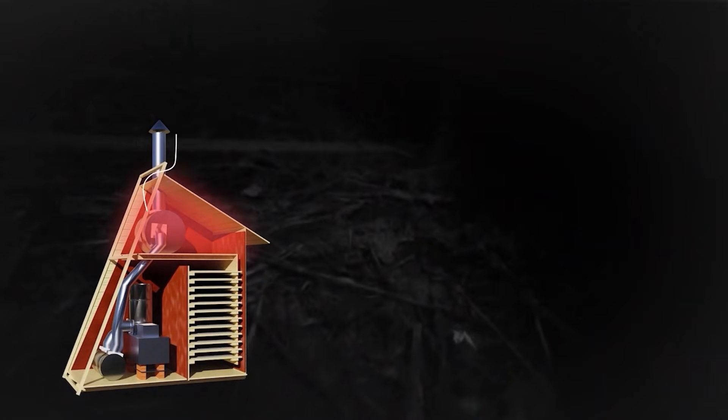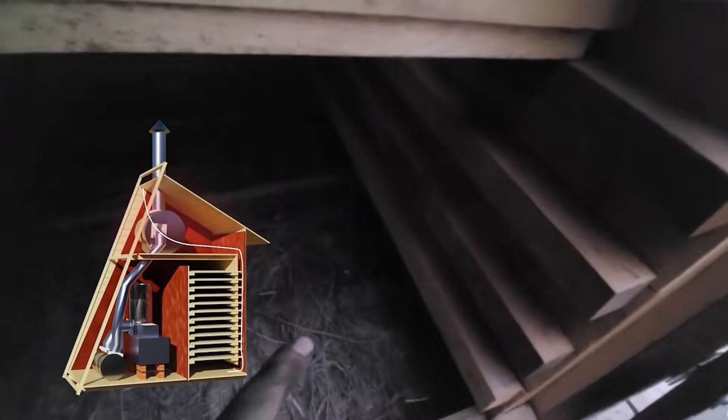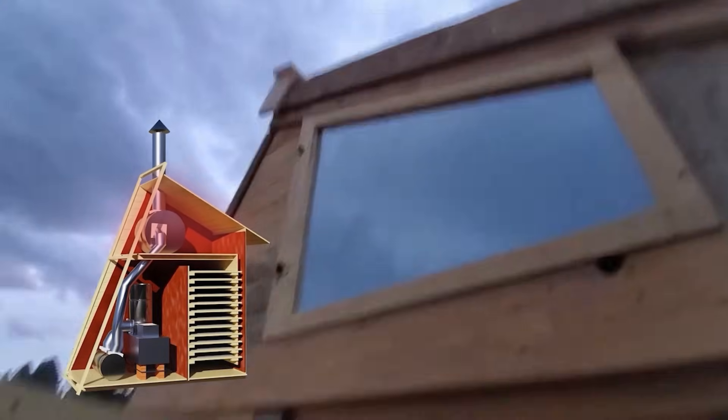There's a slot pulling moist air out of the bottom of this chamber through these screens — there will be about a dozen more screens loaded with apricots, peaches, apples, or similar fruit. The warm air from the other chamber is pulled in, down through the screens, through that slot, then up and out.